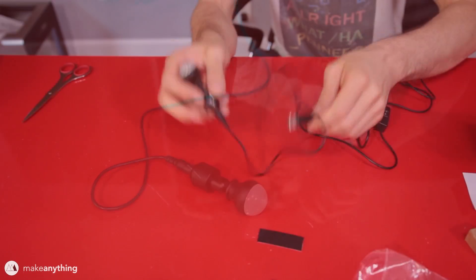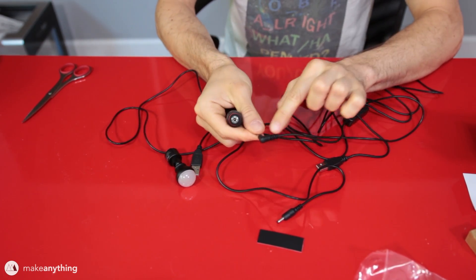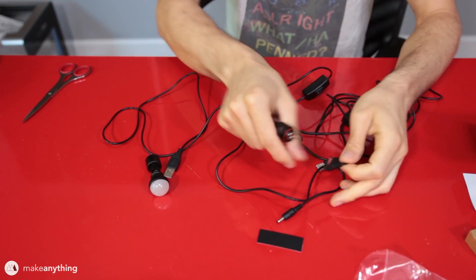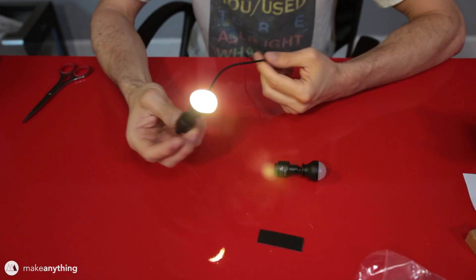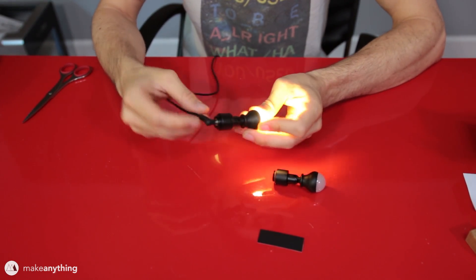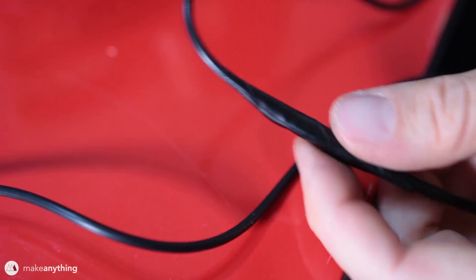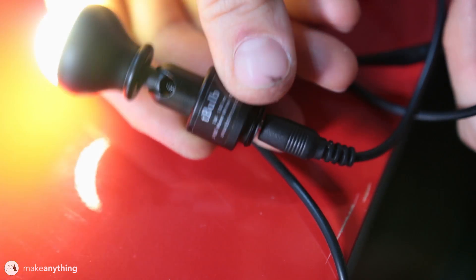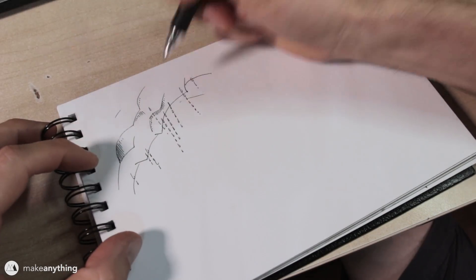I tried to power this one up and it actually wasn't working, so I tested out a cable from a second bulb I had — this one has an L-connector instead of a straight connector, but otherwise it's the same, and this one actually worked. After some investigation it turned out the other cable was only outputting 4.5 volts instead of 5 volts, which is what the light bulb needs. So I soldered a new USB connector to that straight port, wrapped it up, and it ended up working. It seems like it was a quality control issue, which is kind of a bummer.